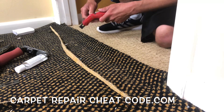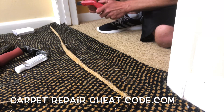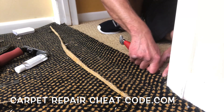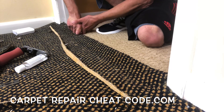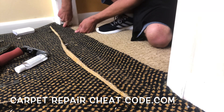Let's go ahead and swap that blade out. Your blades cannot be sharp enough, but also watch those fingertips because it's so easy to lob those off, especially if you're a DIY type and not used to working with these. We're just going to run this blade right along that edge all the way down — just a freestyle cut tracing it out. When we're done, we're going to throw some seam tape under that and get these two stuck together.